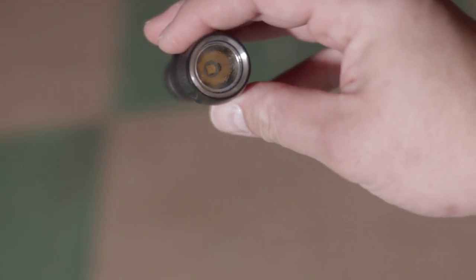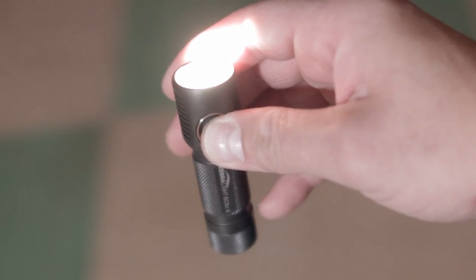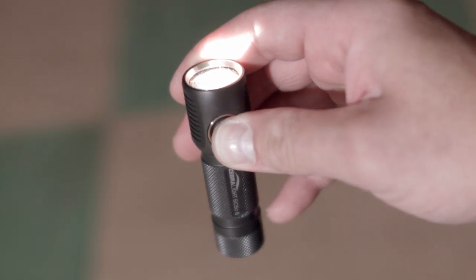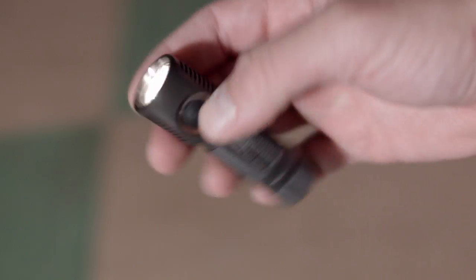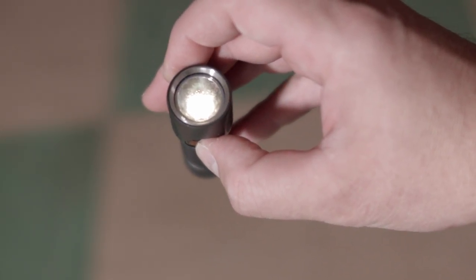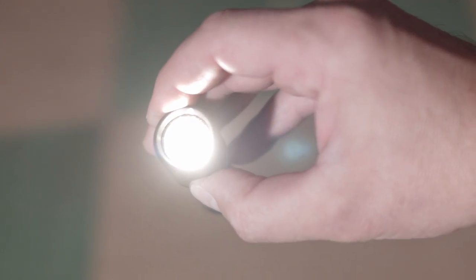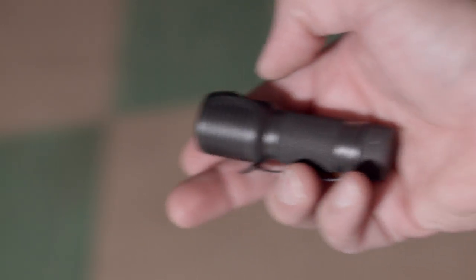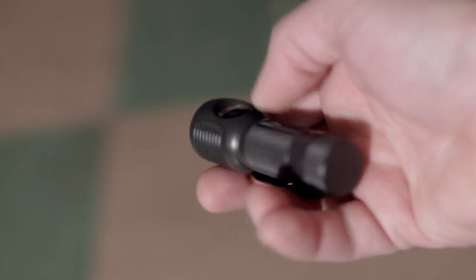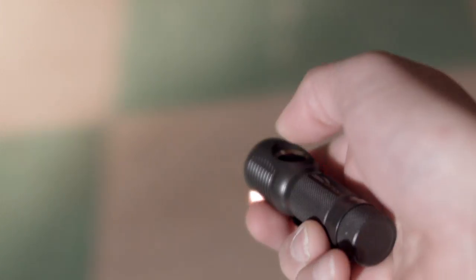Double click once you get in the mode for more than a second. So let's say medium — double click it, wait a second, and then you can double click it again. Double clicking will get you back and forth between those two assignable modes. The last one you use will be saved in mode memory when you turn it off. For example low: press and hold for a second, release. Timing is a little tricky on low because too short and you're on high, too long and you're on medium. Double click to change between low and secondary low — that works on high too. Also when from any mode you can scroll through low, mid, and high by pressing and holding from off or on. To strobe: triple click from off, double click to scroll through them, click once to turn it off and save that last strobe into memory.